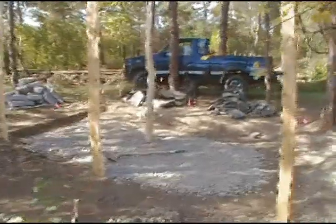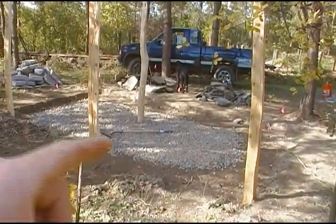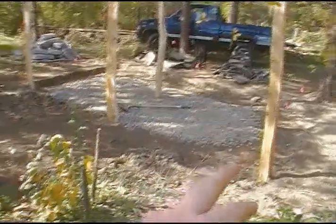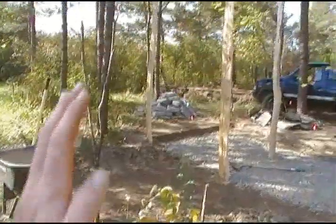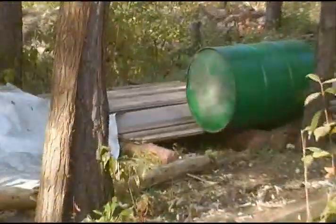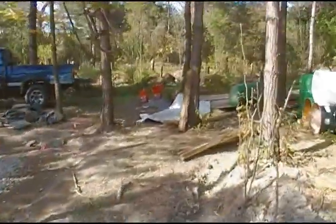A little hard to see from here, but roughly we just took a look at the interior of what will be an earth-bermed home that's about 10 feet deep on the north and south and about 16 feet wide east to west, with a southern extension that will come out 8 feet here. This will be a greenhouse that will attach up. And then the roofing will be sheet metal roofing — you can see I've got a pile over there. That's 13 and a half foot long sheet metal roofing off in the distance, and that's going to go on with a roof.